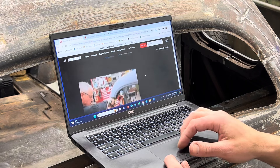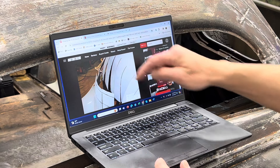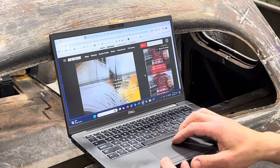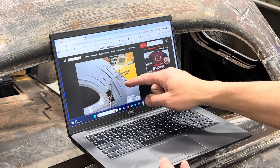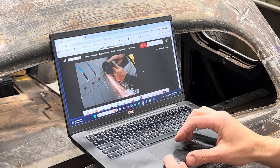In any case, they did something like a three-inch chop on it. I'm going to skip ahead to the roof because that's been the most consternation for me — figuring out exactly how I was going to do that. Here you can see on this picture how they had made all those relief cuts into the roof, just like I did, and then gently folded the lower part of the roof forward, lifted this part up because there was that huge gap. Kind of clamped them together, there was some overlap, then did the relief cuts and butt welded them — cut and butt them back together. It goes through in good detail in this article on how to do that. This is a little bit of the reading, the mind prep that I did getting ready for this build.